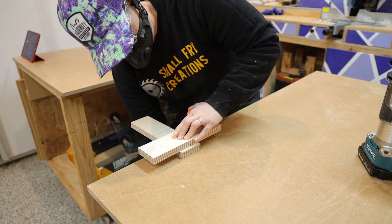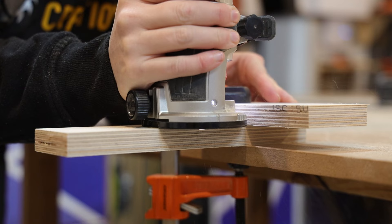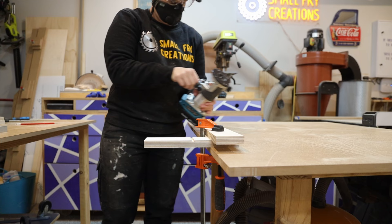It's important to note that when you're using a router bit without a bearing you really need a guide in place. You don't really want to be using the router freehand as they have a tendency to get away from you. When I get to the rabbets I'm going to set my guide in place and then move my router around to clear out the material, so there'll be a little bit of freehand practice. To get a great cut and not put too much pressure on the router bit, it's best to make the cuts with a couple of passes depending on the depth of the cut.